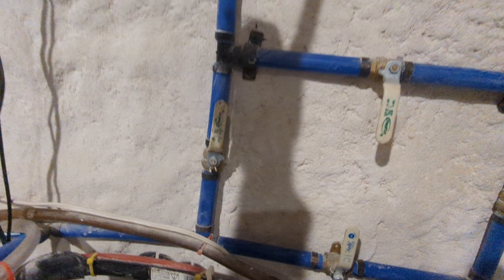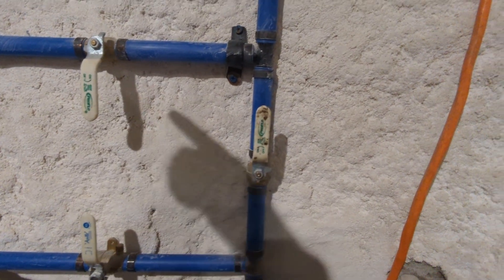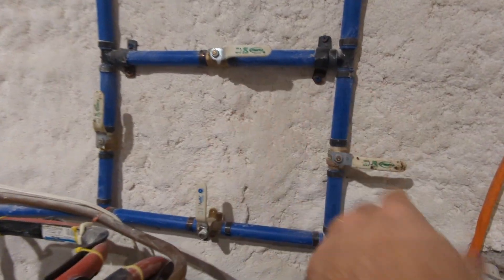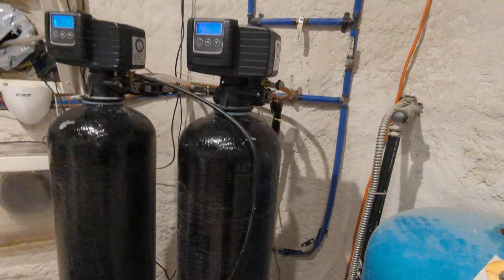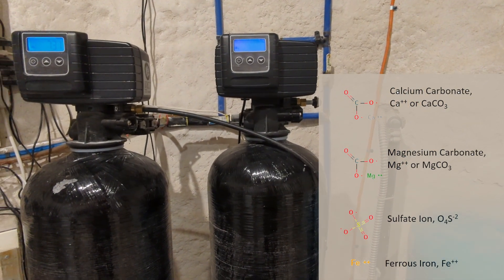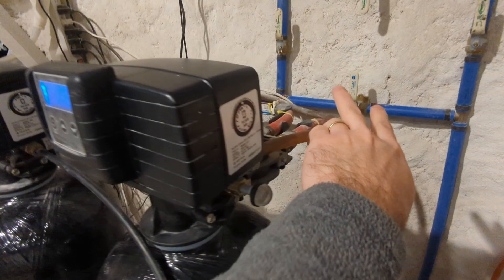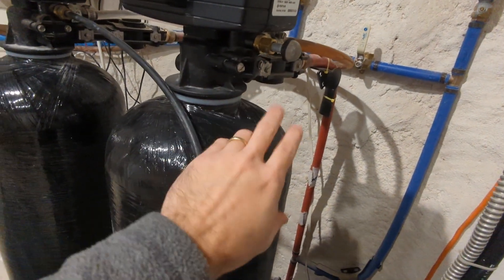The other side goes through a T connection - to the left it goes to the hot water heater, and to the right it goes to the rest of the house. I have valves so I can shut things down if I need to do any plumbing. There's also a valve so that if I want to fill a pool one day, I can turn off the unsoftened water and turn on the softened water - not because I want it soft, but because I want no rust in my pool. I had to get two of these because my water had not just hardness - calcium and magnesium - but also rust and sulfur. The sulfur didn't smell too good, and the rust would make a mess in the shower. So the two filters work in series: it takes out the rust first, and then it takes out the hardness.